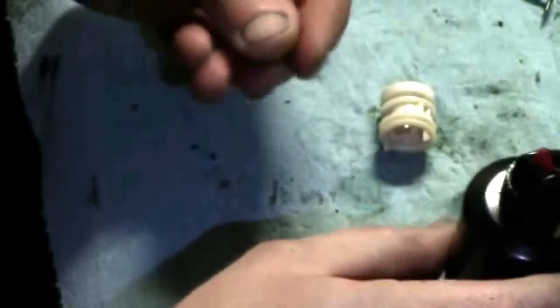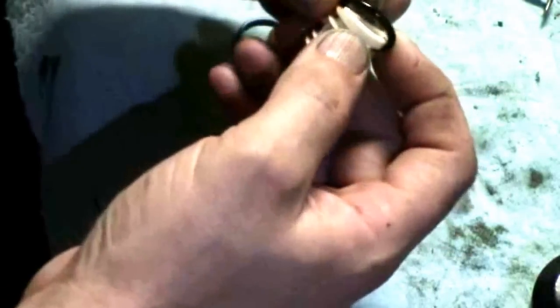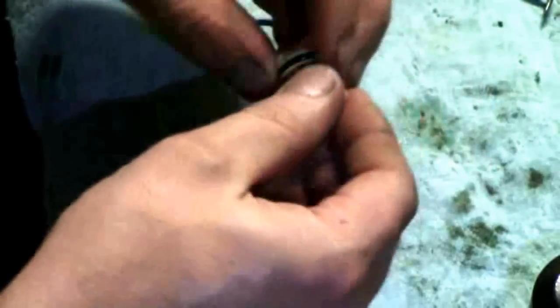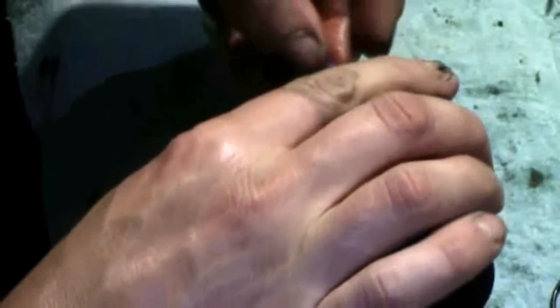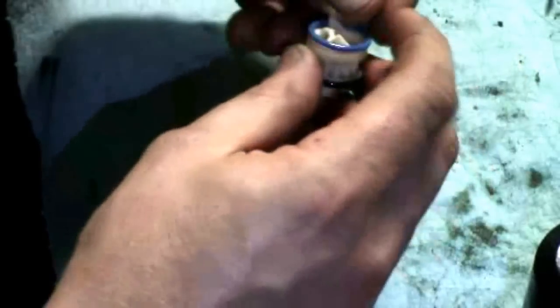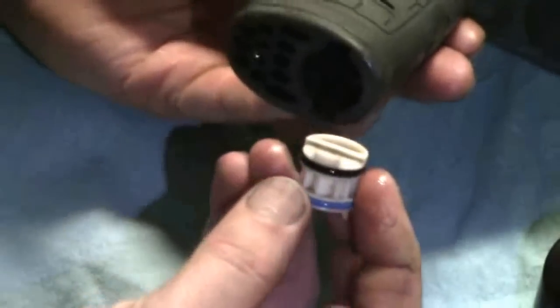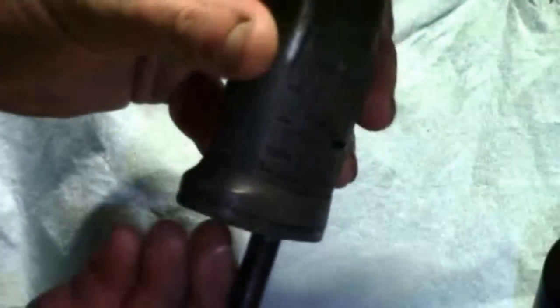New O-rings. All the plastic parts — the buttons, reverse valves, the housing — everything being reused I've cleaned with just mild dish soap. Probably not a good idea to use solvent on these plastic pieces. All the metal components I use in the parts cleaner. Remember: blue O-ring on the bottom, black on the top. The dog ears pointed down. Press that in until it's even with the bottom of the housing inside.